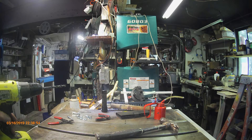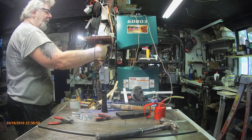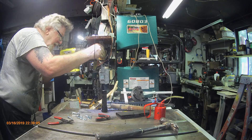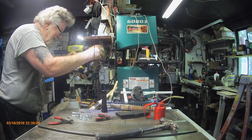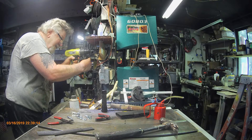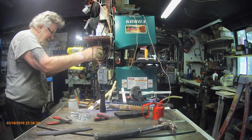I'm ready to start drilling holes on this side. I got the wire run over — it's down behind the bandsaw right in there on that piece. I'm going to drill two holes right there. We're going to throw a couple of nuts and bolts, and I'll make the bolts long enough so I can tie the wires to the back. Then have enough on the front where I can connect a set of jumpers to it. So if I need power, I can just plug in. At this point I'm not thinking about how I'm going to hook them up, but later on I decide to use a quick disconnect power cord. I made a set of jumpers real quick.